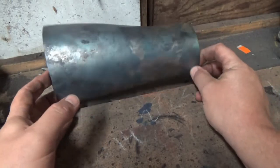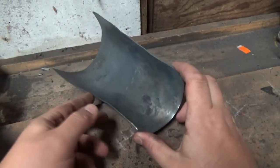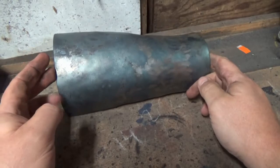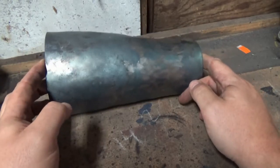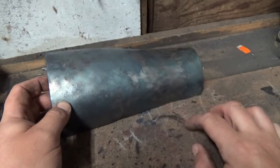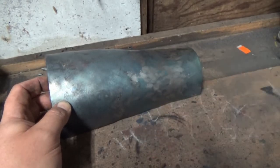This is the vambrace I made earlier using the wooden former, just to demonstrate that wooden forms can work as well as steel. I want to take a quick look at various ways you can planish a piece of material. I'm not going to concentrate on this as a vambrace or piece of armor — those will be for later videos — but I want to look at how you can get out some of these dinks and dents, planishing from the inside and outside. Let's take it across to the stakes.